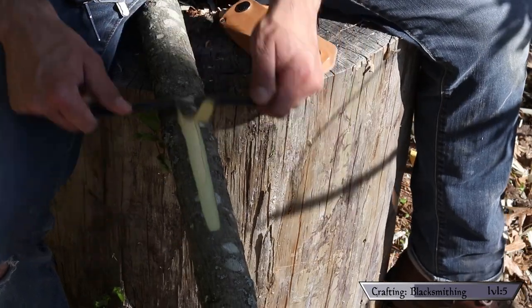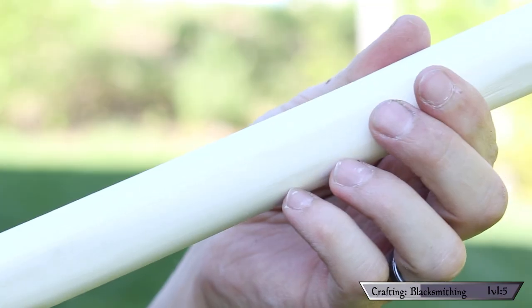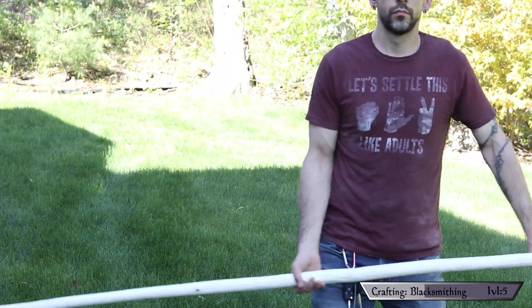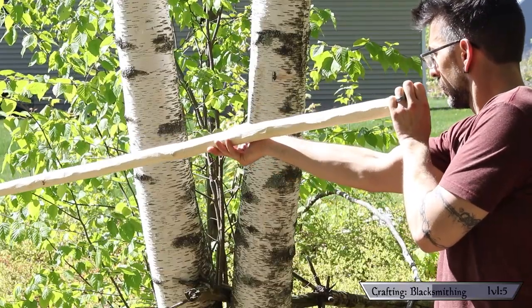The rest of the maple is still really nice — I think I'll turn it into an axe handle, you'll definitely see it in future projects. Determined not to make that mistake again, I started over with greenwood freshly cut from a tree, and this went way quicker. The bark just glided off, the wood beneath was super smooth and easy to work, and I ended up with a beautiful maple staff springy enough to stand up to whatever force I put on it. There was a pretty good bend after letting it dry for a couple of days, but heating the offending area over a fire and bending against the curve straightened it out nicely.